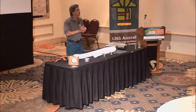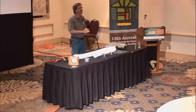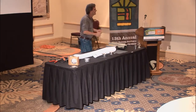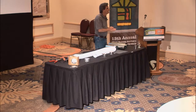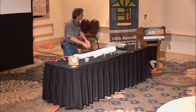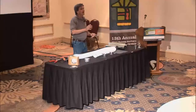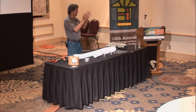And so in rental housing where you're not sure what the population of this place is going to be, whether it's going to be a too humid or too dry a house because of the way it's being used, you have the capacity at almost no cost of doing a change out. So that's an interesting thing to understand, because it's kind of hard to choose sometimes between an HRV and an ERV when you're close to the middle line. Which one's going to work best?